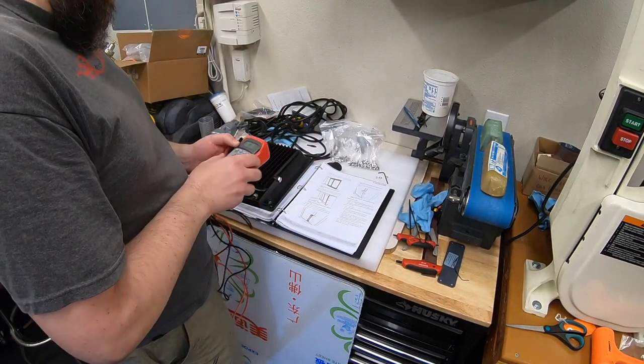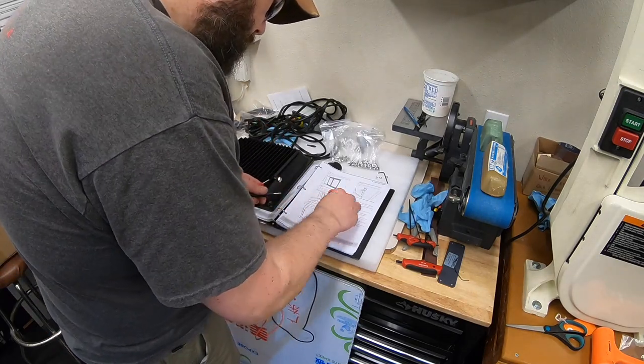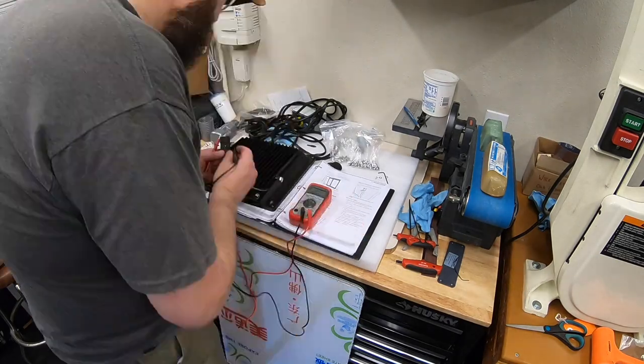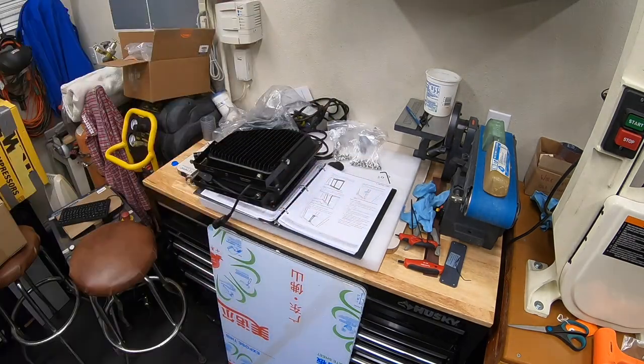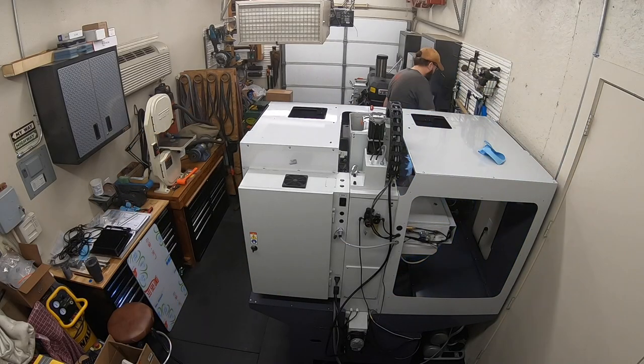And here, putting the lights on, they have instructions in there to make sure you test your lights with an ohmmeter. Make sure there's the right amount of resistance between the clamp bracket and the negative side of the plug. So I followed the instructions. I checked both of mine. My lights seemed fine, so I went ahead and installed those.